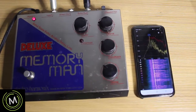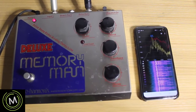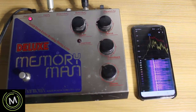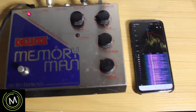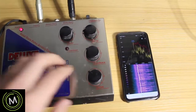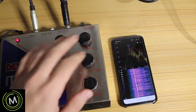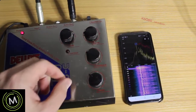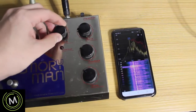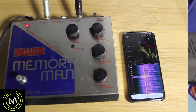120 Hertz is a harmonic of 60 Hertz, which means we have 60 Hertz hum. The first thing I'm going to do when I see 60 Hertz hum is replace some of these power capacitors, because those are most likely the culprit. Everything else works just fine — the delays work — but when you change some of these buttons, some interesting things happen. We'll monitor this and after we change out the capacitors we'll see how it behaves.